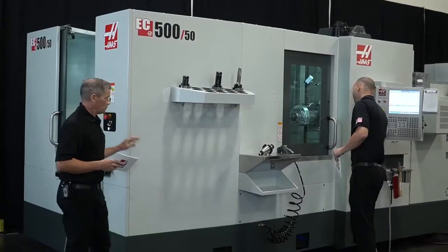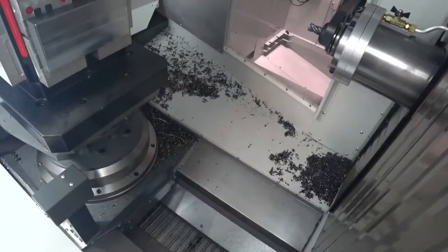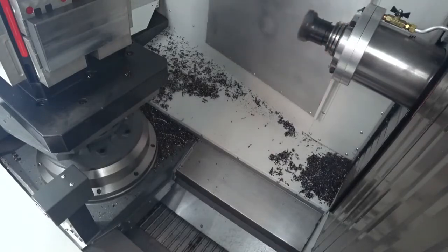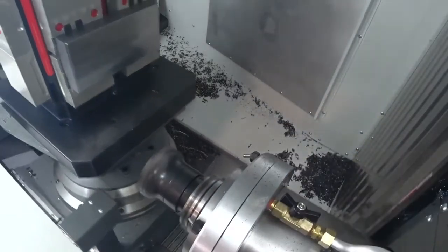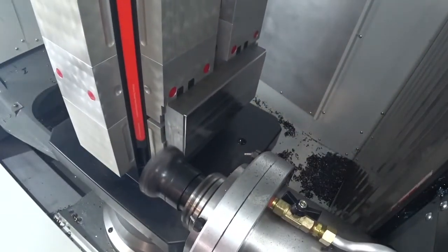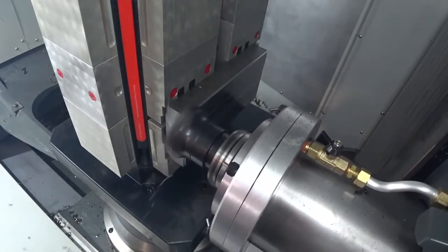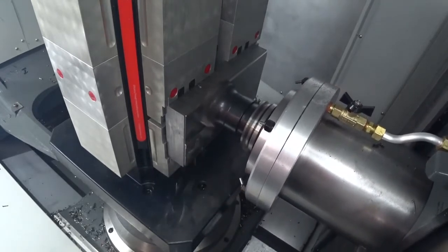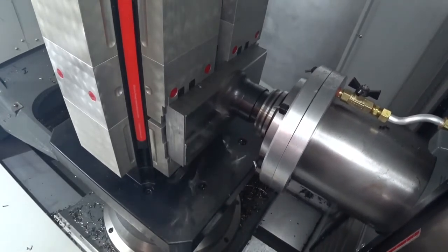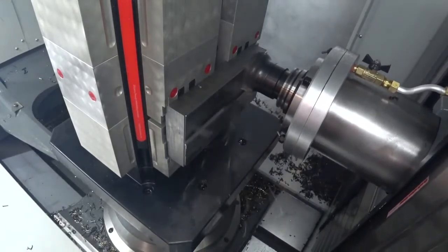So we'll do a little facing pass here, go around the outside real quick, and then I programmed some real aggressive slots with the Haas 1-inch steel end mill. We're going to do a 1-inch cutter, 1-inch deep, full slotting, and she purrs beautifully. Taking 100 thou off the top here just to represent slightly uneven saw cut or something like that.